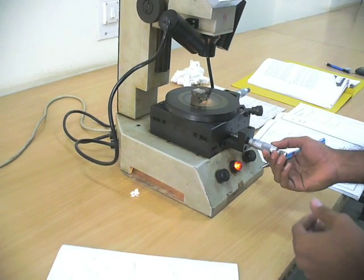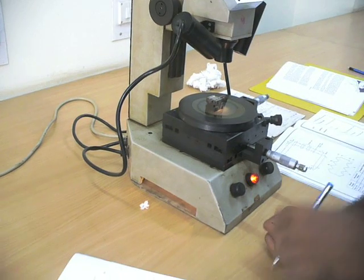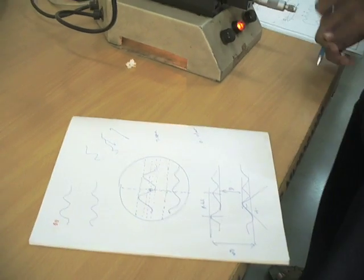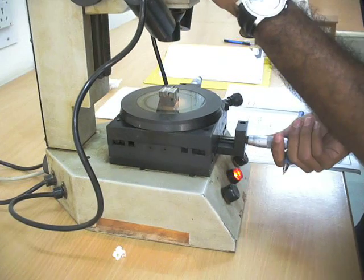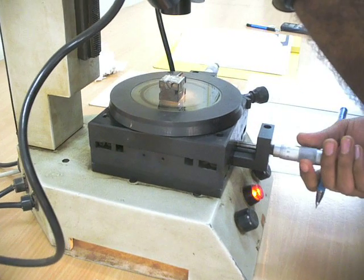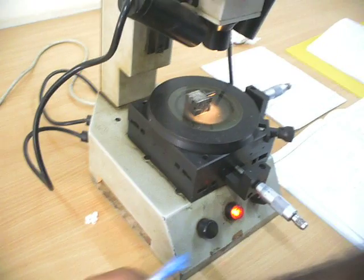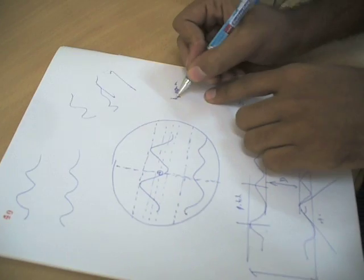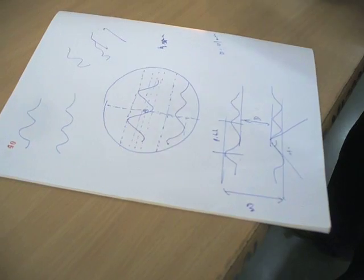And you'll use the least count. Least count is 0.01, so it cannot be just 3.4. It should be 3.40 or 3.41. It is 3.40. Okay. And now you'll look at this, and it's 4.28 mm right now. This is the initial reading, and you'll bring this line to this line by using this front slide micrometer.